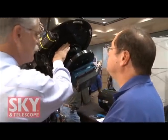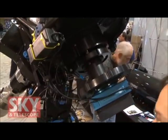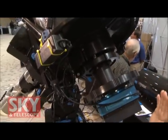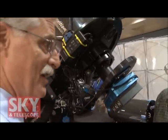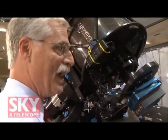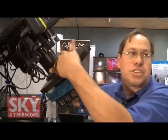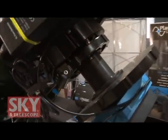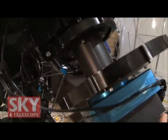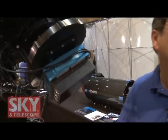That's heavy duty. How much weight can you put on the back of this thing? I would say 40 pounds. It can actually lift 200 pounds — I've actually stood on it and had it lift me up. Obviously lifting power isn't the issue; it's flexure. I had the pleasure of reviewing one of your telescopes a year ago, the 12-inch model, and I said I had never had a camera coupling system as rigid and strong as the one that was built into this — it really was a superb system. We call this the secure fit system with CCD spacers. Everything bolts on. It takes a little bit longer to put them on, but we have heavy, very expensive CCD cameras and you just can't have anything move. Secure fit is the only way to go in our opinion.